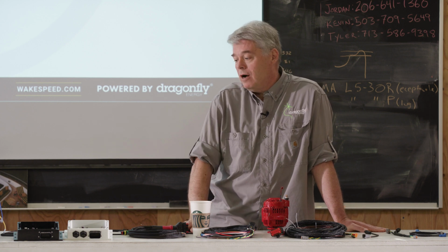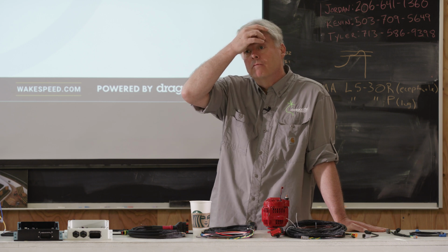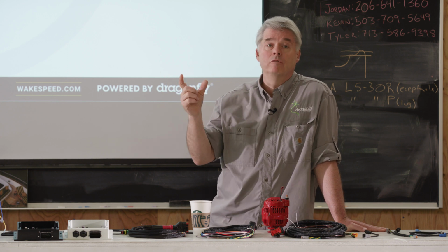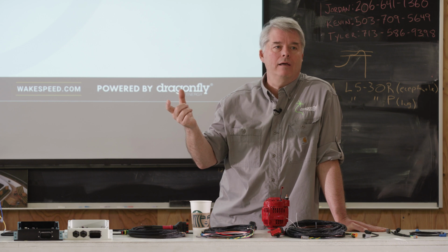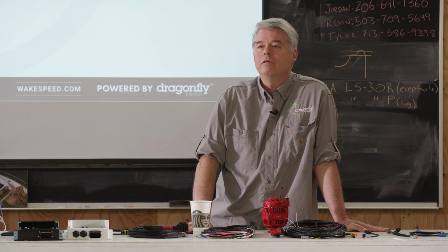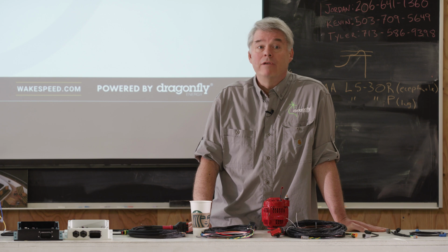The other thing that I'll comment on, you asked about how do you know if it's sufficient. I think our experience is the reason they've gone away from V-belts to the multi-rib. There's a lot of reason for it. One is they'll definitely do more power. We routinely see 8 kW heads, 9, 10 kW continuous duty with a multi-rib secondary alternator in the motor world. So those belts are definitely capable of it. If you have any questions, ask who you're buying these from.